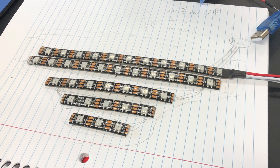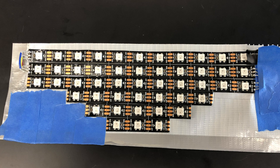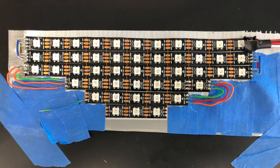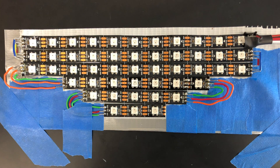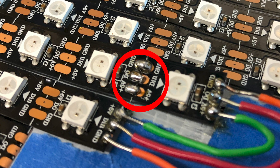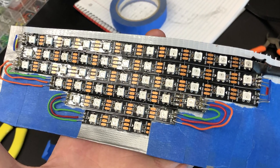I cut the LED strip into the rows that I had laid out beforehand, and removed the protective rubber that was covering them to expose the copper between each LED. Once that was done, I taped them all down the way I wanted them positioned in the mask, and then got to work soldering the connections back together in the new formation. This was a tedious process that took several hours. At one point, I messed up and connected the copper that controls power to the copper that takes in data from the board, so I had to remove that LED altogether and solder in a new one. You can see the connection here where I had to solder in the middle of the row. After fixing that and checking the connection several times, I got through the rest of the soldering. Then it was time to test that the lights worked, even in their new formation.